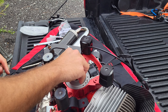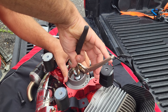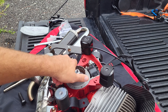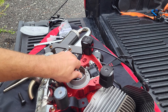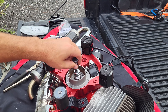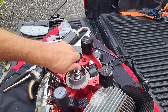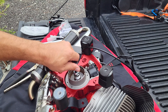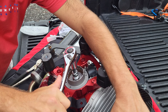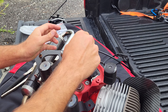Now we're going to thread this piece in until it is snug. Then you want to rotate the flywheel all the way to the right hand side. Now go ahead and insert the black screw bolt. This requires a 19 millimeter. We've got our socket with the 19 millimeter on there and this is where we just tighten until it comes — there we go, you felt it kind of come loose. Then you can go ahead and pull this flywheel off. And there we go — the flywheel still looks really good.